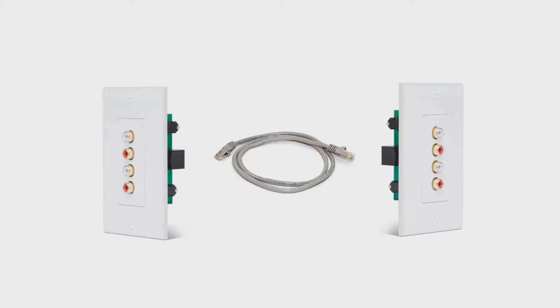Three: with the use of some audio adapters, CAT cable can also be used to send an audio signal over long distances back to the central location. If you don't plan to install a link system, consider home-running a separate CAT cable for TV audio, media players, and other audio components.